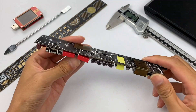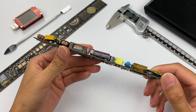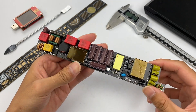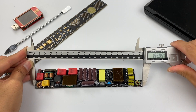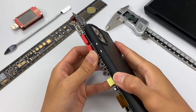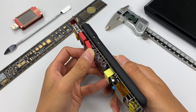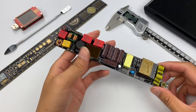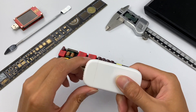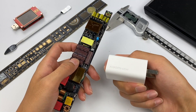Today we will share this LED power supply with you, whose power is 200W. Just because of GaN components, it can reach 200W using this flat and ultra-thin PCB. The length is about 196mm, the width is about 35mm, and the thickness is only 12mm — almost the same thickness as an iPhone 12 with a case. The power density of this power module has reached 2.5W per cubic centimeter, equivalent to 1.6x of the Oppo 50W Mini SuperVOOC charger and 2x of the Xiaomi 65W GaN fast charger.